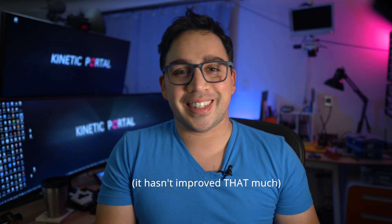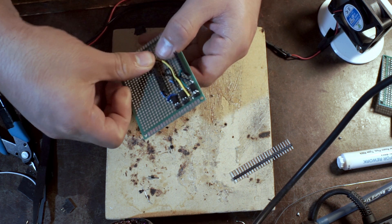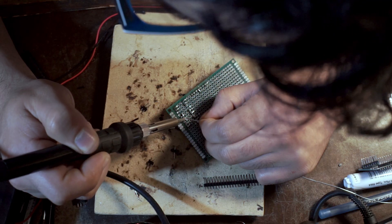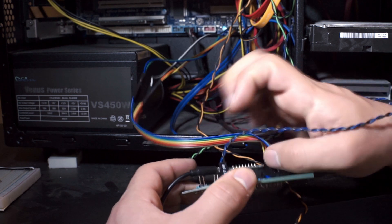So I fixed it. I also added a bypass for the buttons, so if I press the original power or reset buttons, they bypass my device altogether and still work as originally intended — even if my device is powered off.